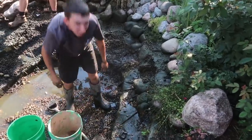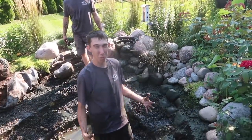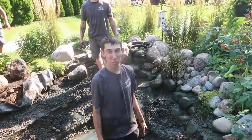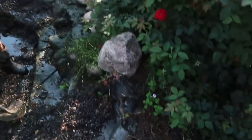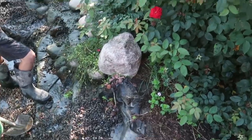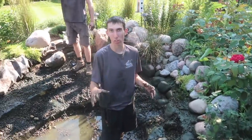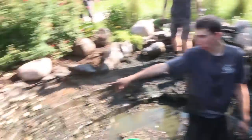Jack, I see you're using the shovel on the second shelf because those cobbles are locked in — why is that? Because whoever built this used foam instead of gravel to backfill. They also did that up here on the top edge — why is that a no-no? It's a pain to tear out, and because it leaks. All the edges on this pond are super low and they came back in behind it with foam. To be fair, foaming the bottom cobbles probably made sense because they were falling down, but foaming all the edges — especially in this corner — is a problem.